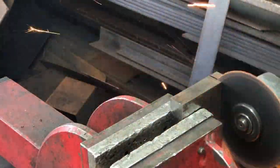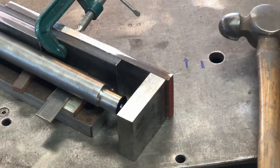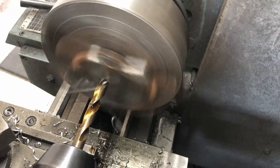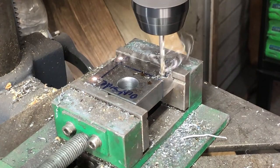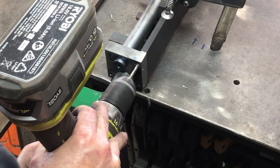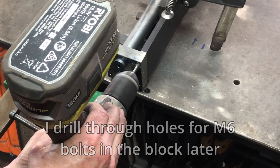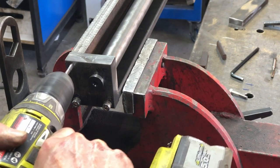Now I start working on the block for the back. This one is a little bit different because it bolts on, and I don't really have a good way of working out where the centre hole needs to be, so I put a bit of bearing blue on there, knock it with a hammer, and it makes a mark. Again this is drilled out and bored to the right size. I've marked out where I need to drill my three holes to hold this in place and those holes are drilled out to 5 millimetres for M6 screws. I use this block as a guide to drill into the rest of the banjo and that's where the threads will be tapped. I do one hole at a time, making sure everything is all lined up nicely.